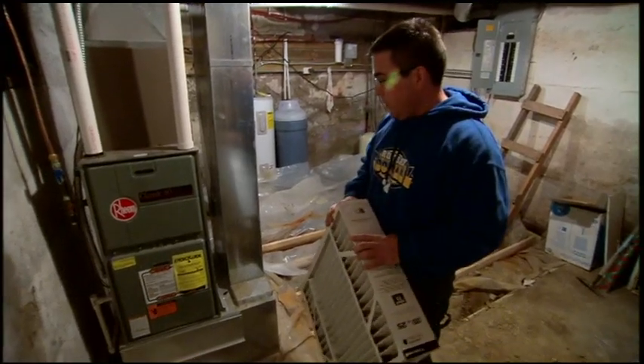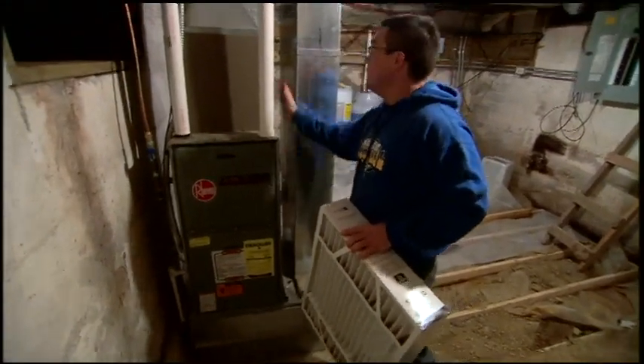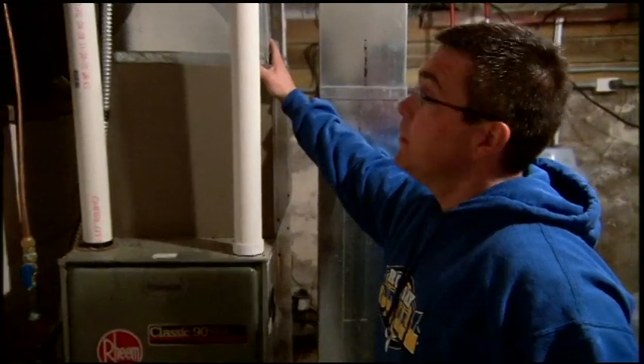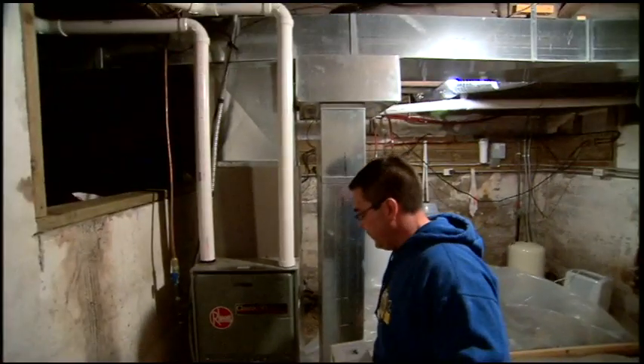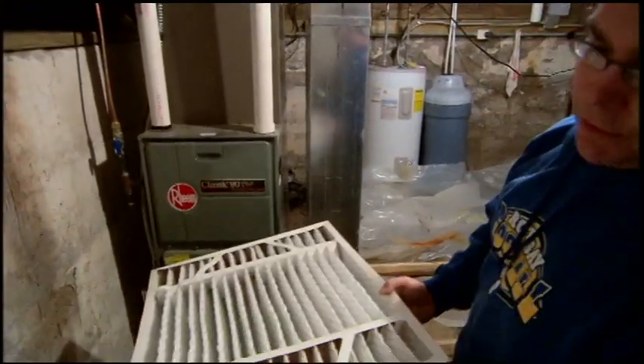The way to look at where the air is flowing — usually the furnace is here with the heat. Above it there's going to be the area called the plenum. The plenum is just your main duct. There are supply ducts branching off and going up to different rooms in this home. So the airflow is moving up, and we want the arrow to match that.